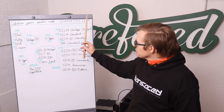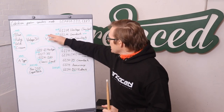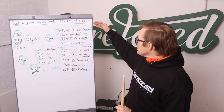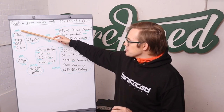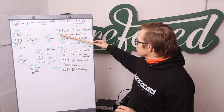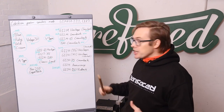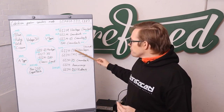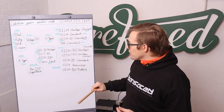Hopefully this is making more sense now that I've grouped the different Celestions in their different ways. There's a progression within the groups as power handling increases, needing more power to break up. You can also choose things with lower sensitivity if you want to break up at lower levels, and there's increased smoothness and fatness as you head towards increased power handling within the groups on the whole.